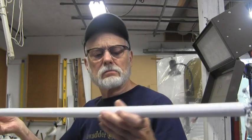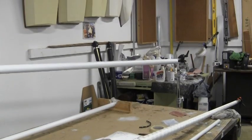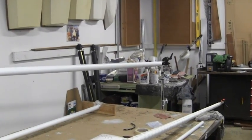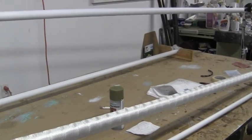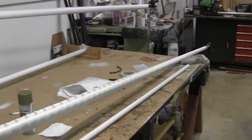It's a new day and I have all the tubes all painted. So we had the initial etching paint sprayed on over the cleaned and sanded aluminum tube, then put two coats of primer on it, and then three coats of flat white paint. I like the flat white so it's not going to shine in my eyes when you're looking up. I took some of my grip equipment and set my mast up so I could paint it, and the same with the boom - I was able to get some parts together and keep it off the workbench, making it easy to clean.